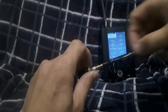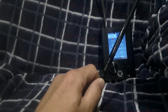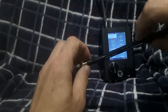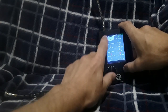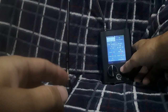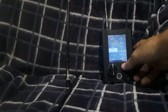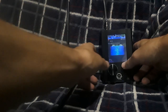This antenna is a very durable feeling overall — very stiff, nothing like the other one. It'll really hold in place for you. It has different markings to help you tune the antenna, and you can also go into your utilities on the PortaPak and go to antenna length, tune in the frequency, and find out the length of antenna you need to extend. Let's go ahead and show the difference. I'm going to extend it all the way and do some basic RX receiving. I'm in a basement right now so it won't be the best — that's why we're going straight to FM radio, because I know that will be picked up much easier.